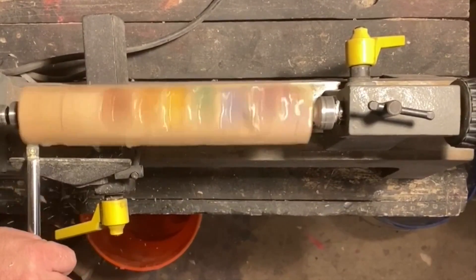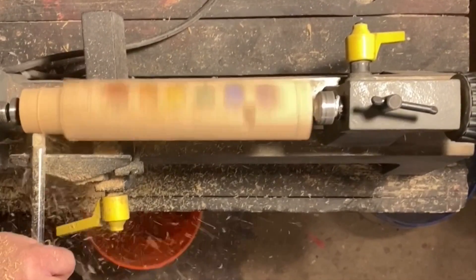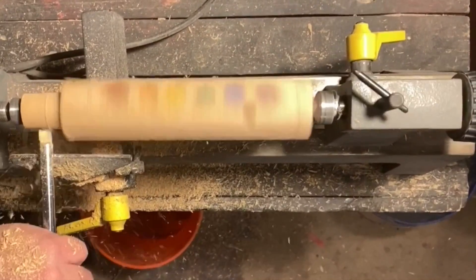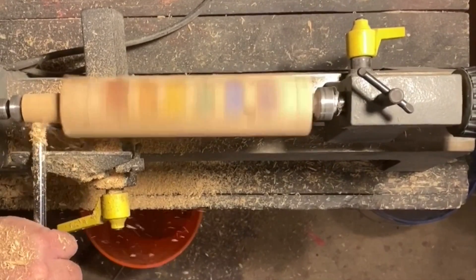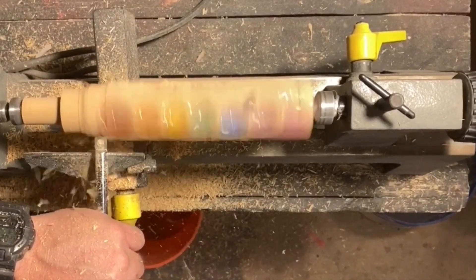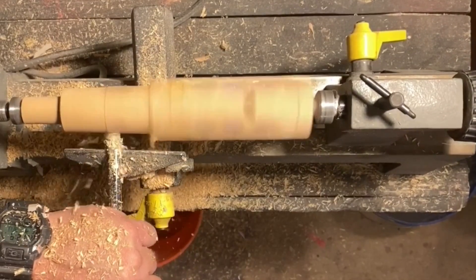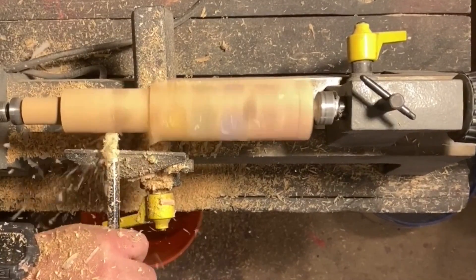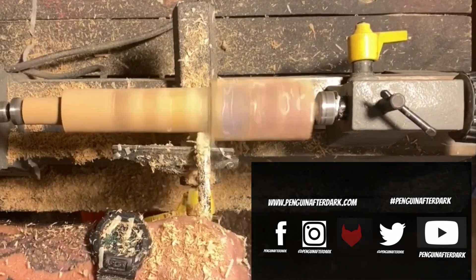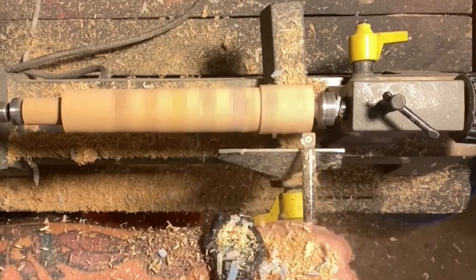I like to give it about two to three days of curing just to be sure. Then I go to turn the handle on the lathe. This process actually took 15 minutes — turning on a lathe is super easy and doesn't take a lot of time, but I sped it up to just shy of three minutes because it's still fascinating watching the de-evolution of a block of wood into something round. On the left-hand side there's the post that the leather falls will be wrapped around. The first step in turning is getting the whole thing rounded. Sometimes you can run a blank across your table saw to knock off all the corners — I usually don't do that for small handles, but for bigger blanks I definitely knock the corners off because it makes life so much easier.